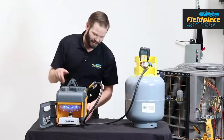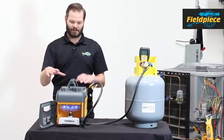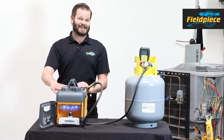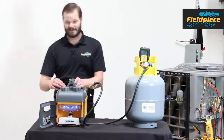This vacuum pump is the 8 CFM, which also has a DC motor. This gives it a little bit of extra speed as well as not having to worry about low-voltage drop across your extension cord, because it can run as low as 95 volts. You'll also notice that it's very quiet and it's not shaking around — that's also attributed to the DC motor.